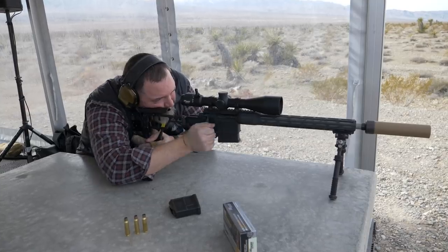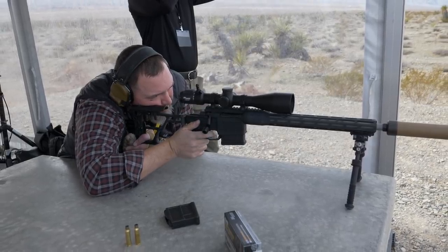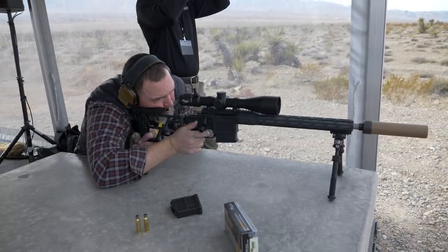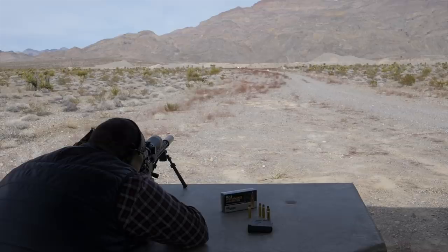Let's talk about the barrel. We're going to make those barrels in-house — they're buttoned stainless barrels. As far as how they mount up to the receiver, they are interchangeable. We actually have a barrel nut and barrel extension configuration where the headspace is set at the factory. There's actually a system that allows that headspace to be adjusted to remove tolerance — unlike an AR where you just torque your barrel extension on, here we can actually tune it in, turn that castle nut, and lock it into place to set the headspace exactly where we want it. It goes in just like an AR barrel nut, and you can take it off with a hex wrench and change your barrel out.